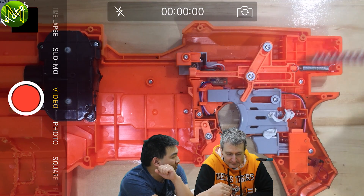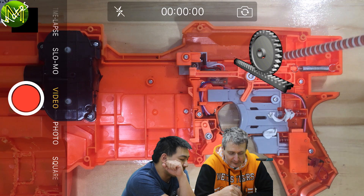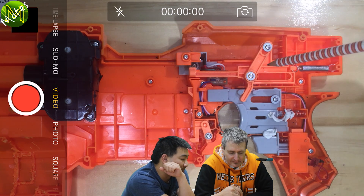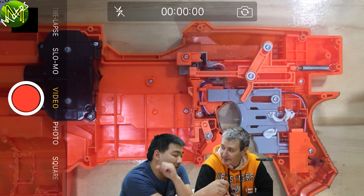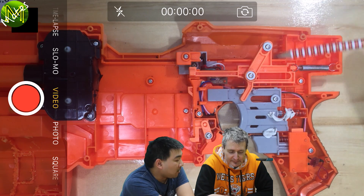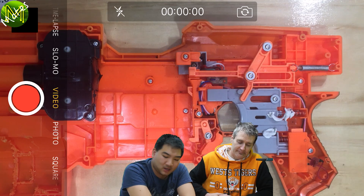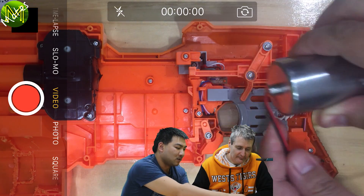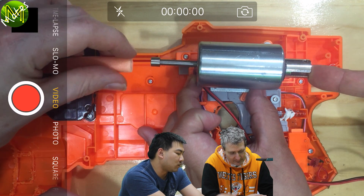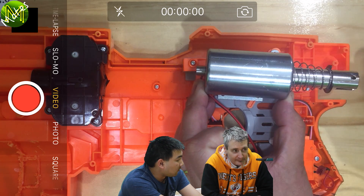There are a number of different ways you might electrically make this go fast. There's actually already a kit out with a little motor that sits on top, and it comes with a replacement pusher that has gears - basically a rack and pinion. The pinion has half teeth, so it pushes the dart out, and when it reaches the missing teeth it slides back spring-loaded. But there's a complete analogue relationship between the trigger and the motor, so you can't do a three dart burst unless you have very good timing. I'm attracted to the solenoid because it's a very simple mechanism - you apply power and it comes out, then take away power and it retracts. The Arduino needs to know when to turn power on and when to turn power off.